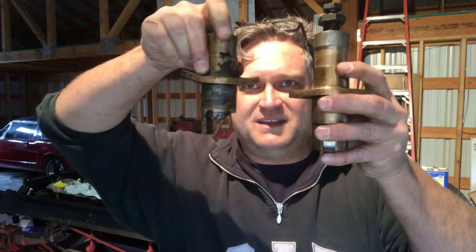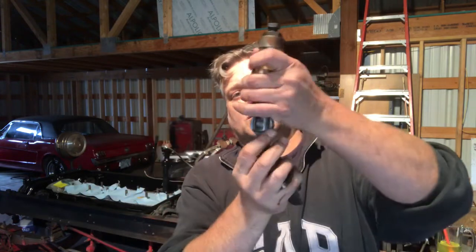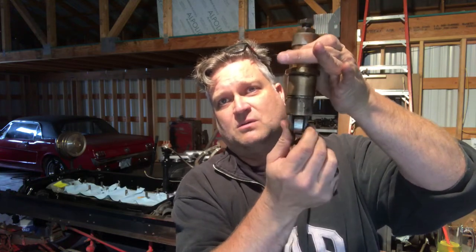You see that? That's the bottom end of the lifters, and there were a bunch that had been blown off. What I think happened is, at the auction, a vehicle's always worth more if they can get it running. So I think they decided to try to get this rig started, and they forced the motor over, and a bunch of the valves were seized, and these might have even been seized, or the roller got crooked. If it's not adjusted right and it's hanging too low, there's nowhere for it to go. So it just obliterated not just the brass, but the whole steel underpinning there.